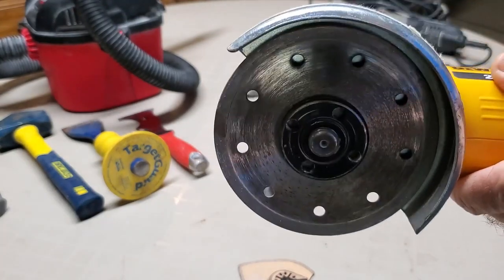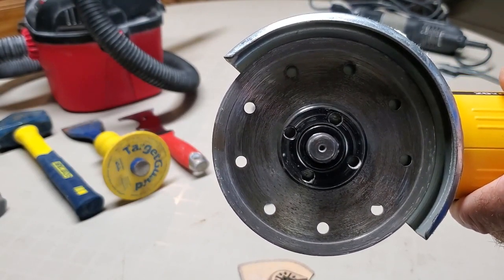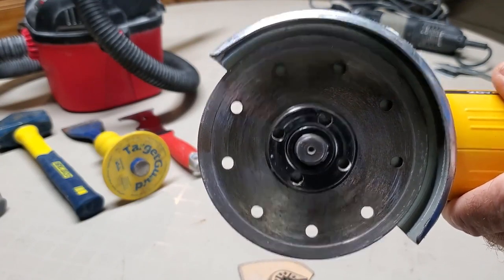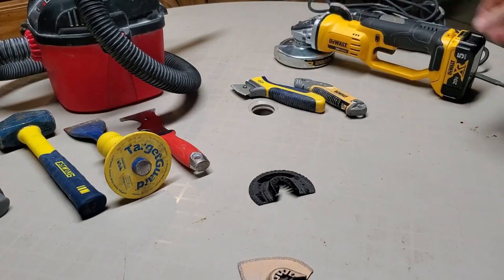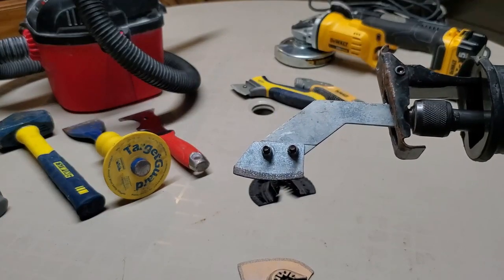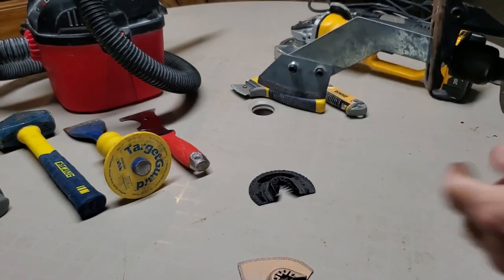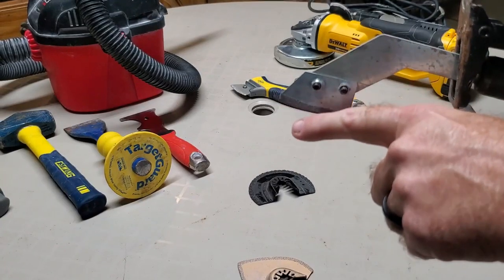And if you're doing a lot of grout, I would sheet off the room and use this tool. Typically, when I just do grout replacements, this really is my go-to tool, just because the blades are cheap and it's effective, and you're only trying to remove about 1/8 of an inch of grout just to get the new grout in.